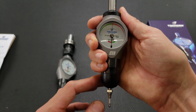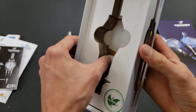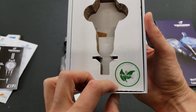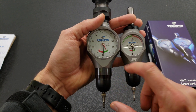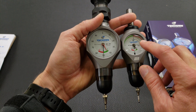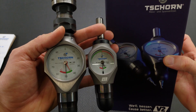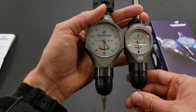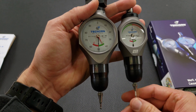I made a comment about the packaging being renewable compared to foam, and it's actually all cardboard — it even talks about a green packaging solution on the box. Looking at noticeable differences besides size: the V1 was more like a dial indicator and could be used as one at just about any position. The V2 does have markings, and the same goes for the V2 Plus size — minimal markings, and it doesn't even show the increment. I assume they're 0.01 millimeters, but it's not really treated as a dial indicator anymore — it's really just a centering tool, an edge-finding tool, or a Z-finding tool.